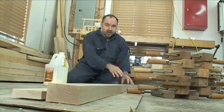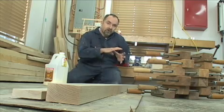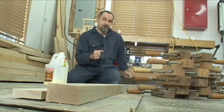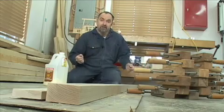I've got a piece of 8-quarter ash and to that I'm gluing a thinner piece of ash about 1 inch thick, putting them together. I'm working on the floor because this is a long piece of railing I'm making — about 9 feet — and I can't do the work on any one of my benches.